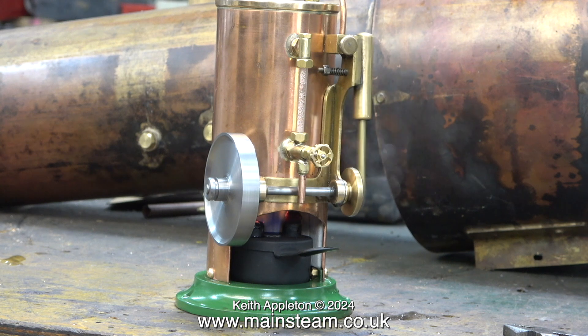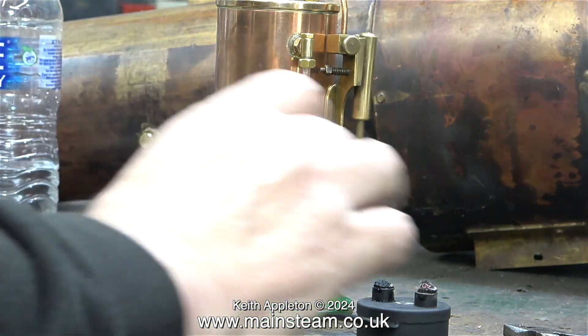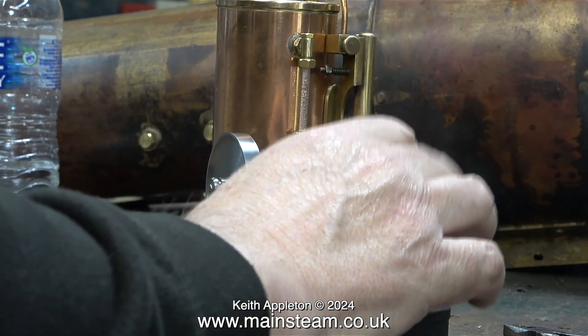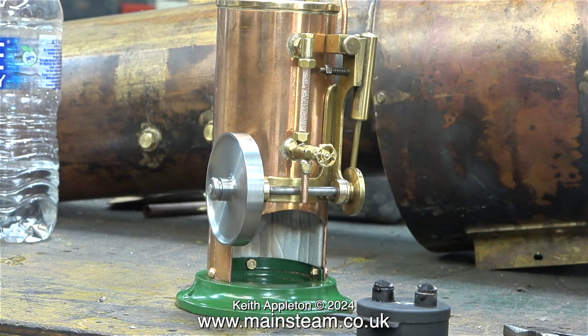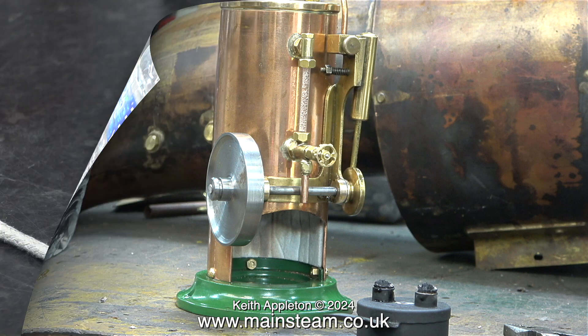This is not good. It's a very old type of wick material and it's not asbestos — it's just ordinary cotton. The engine continued to run for a while after I removed the burner, and as you can see the wicks are very badly burnt and very short now. You can also see by the water gauge that the boiler is nearly empty. I had to drain out some water to even get this burner to raise steam.